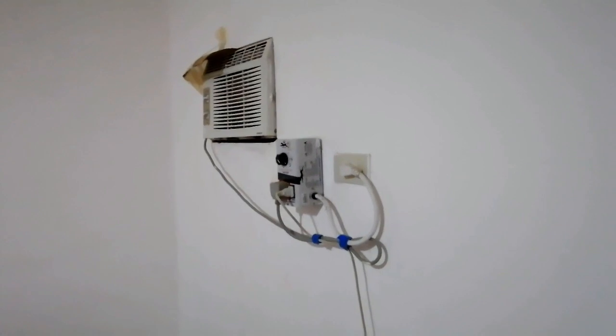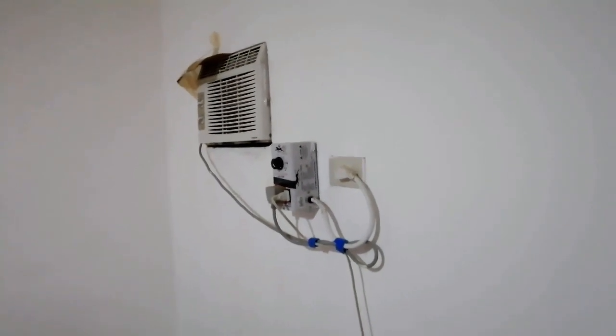It's just that the bottom fills up with a kind of snot layer and gets really gross. Pull it out and clean it once a year and you'll save a bunch of money and it will work better. The air conditioner is clean - I do that once a year, it saves a lot on electricity and makes it run better and last longer. I recommend you do it - it's very easy. If you can't fix it with a water hose you need a new one; they're not worth fixing, but cleaning is a good thing.